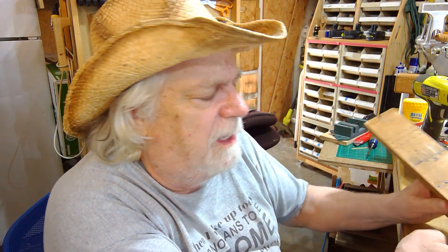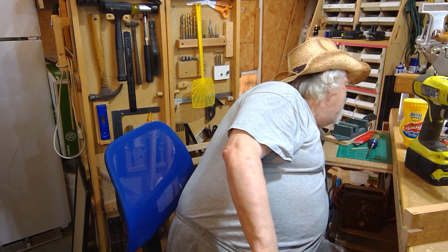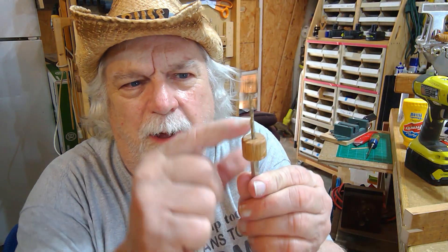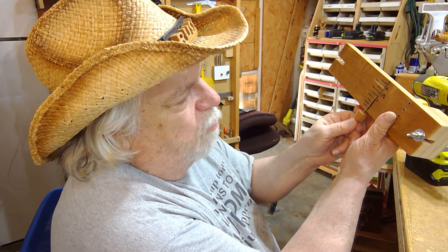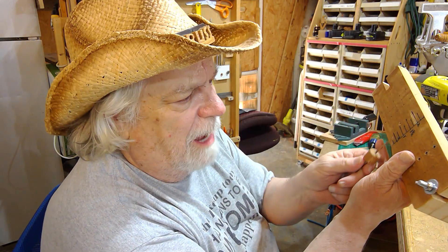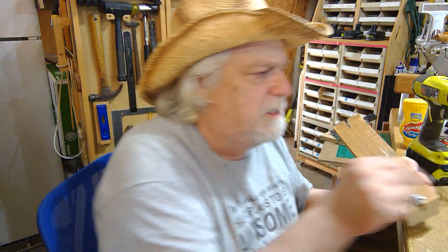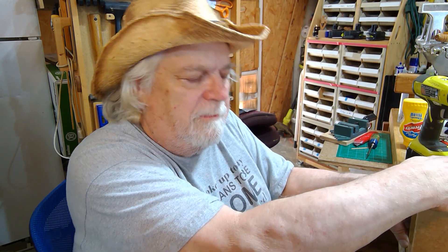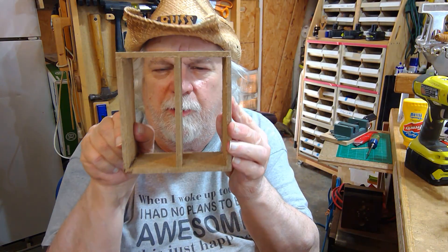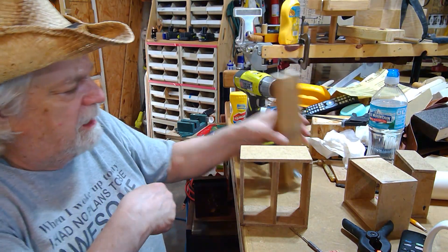For butt joints I'd use the 12 degree, but there may be examples where you want straight up and down, so I'll probably put at least one straight-up-and-down hole in there too. I also put a scale on here so when I want to measure and put a stop on one of my drill bits at a certain distance, I can quickly use this as my reference and get it set within a quarter inch or so. Besides corner joints at 12 degrees, what if you want to put a box together? Because it's a removable fence, I can use this on flat surfaces too.